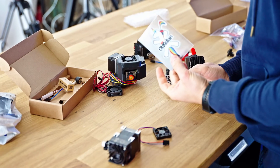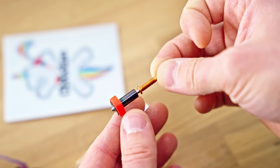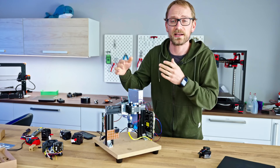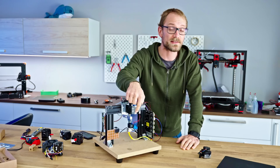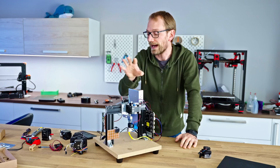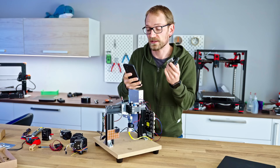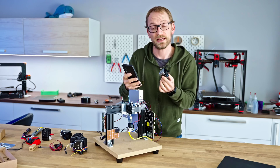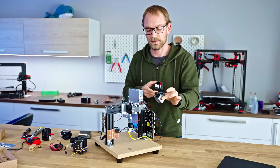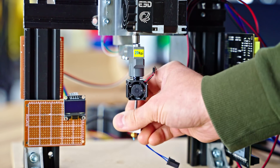Wait a minute — why is there an Obxidian sticker in here? It is an Obxidian! I did happen to ruin all my other ones in the testing I did, so that's nice of them. Say hello to my little friend. This is my extrusion force tester that I've used to test extrusion forces of hotends in the past. I'm gonna mount a regular Revo with the standard heater and use 210 degrees with PLA, and see how far I can take each of these extruders until either they slip or they skip. For the Revo Roto, the recommended current is 450mA peak or 318mA RMS — this quite potentially could just burn up if I plug it in like that, so I'm gonna need to measure and tune before I hook stuff up. I'm gonna set a baseline with the Hemera and then drill some new holes and mount some different extruders.